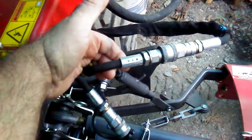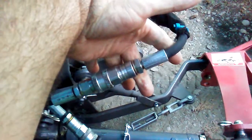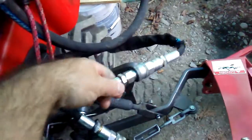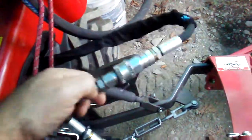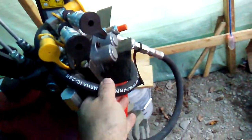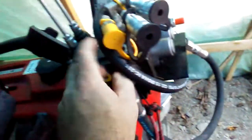The pressure port is the male fitting, and the return is on the other side. The blue one is the return, and the yellow and blue is the pressure. Make sure you ask your dealer and plug the pressure on the pressure port, and plug the return on the T — that is the tank port for the return to the tank.